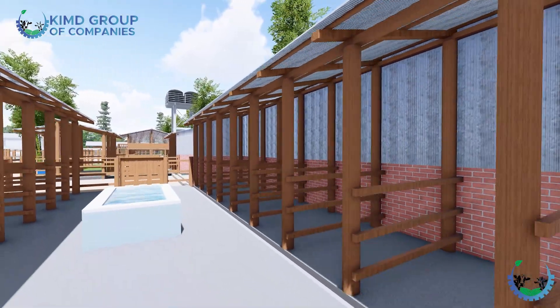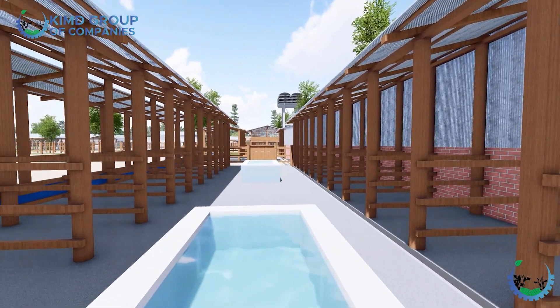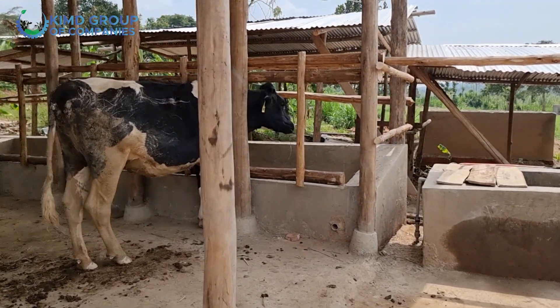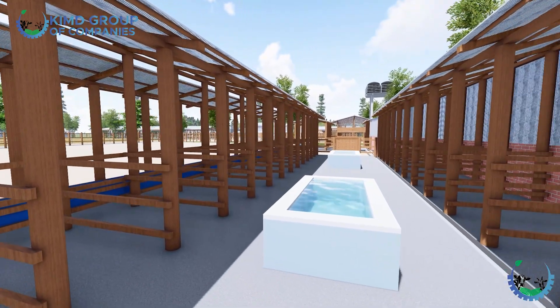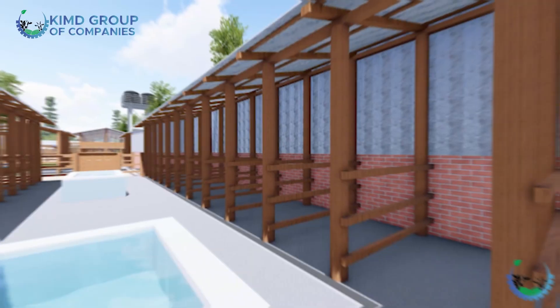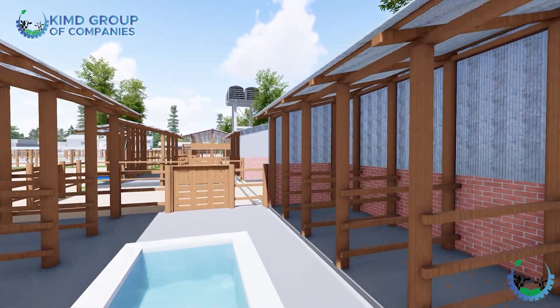The other thing we have about the structure is the flooring. The flooring is made of concrete for easy cleaning and hygiene. Concrete is easily cleaned — when you pour water and scrub, it's easy to wash off all the dung. We also address the hygiene by ensuring there is no stagnant water collected around the concrete. The floor is slanted slightly towards the drainage channel, and you can easily see the drainage channels on our design plan. Urine is swept off to the waste pit.